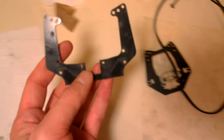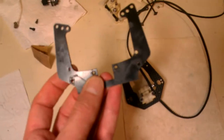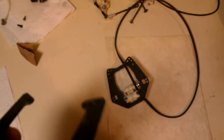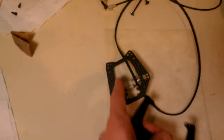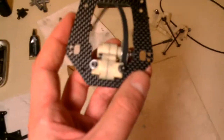Of course, I also did that to line up where exactly to drill these two holes. I drilled those with a 2.5mm drill bit. I think that's a little bit smaller than a 440 thread, but I did that on purpose so that when I screw the screw in, it actually threads in there and tightens up. In any case, I used this as a template for tracing out how much extra material I'd have to remove from the bottom of the front tower.